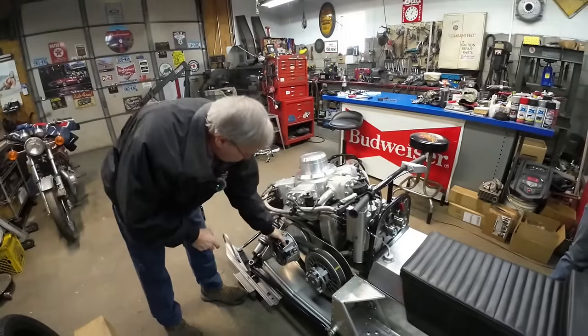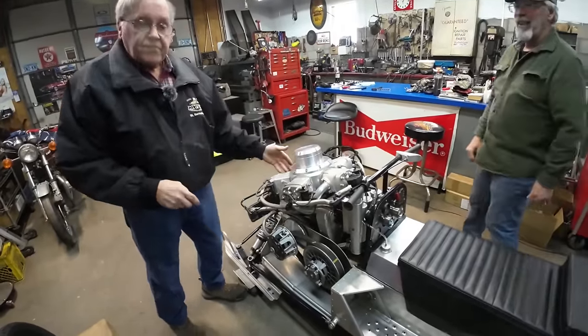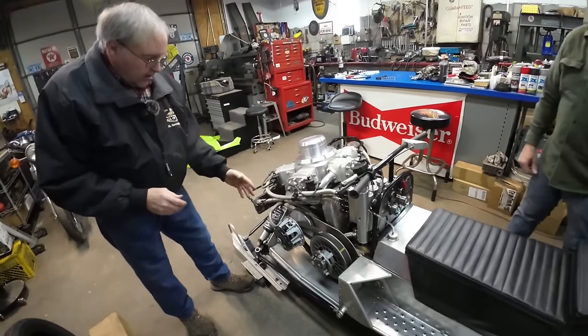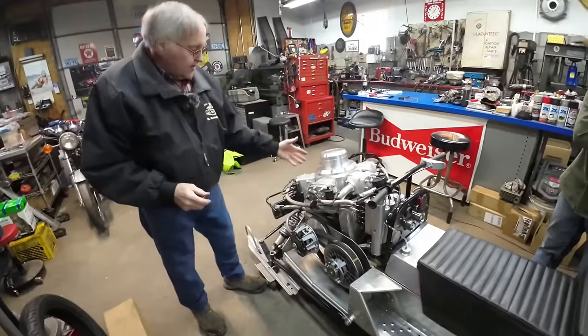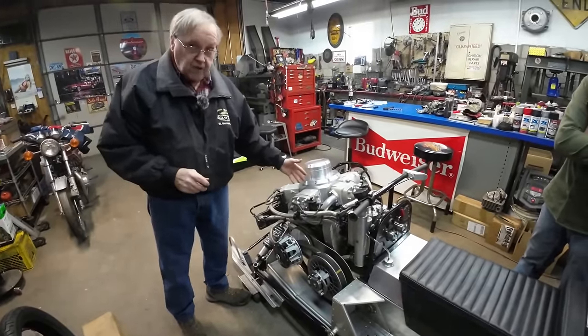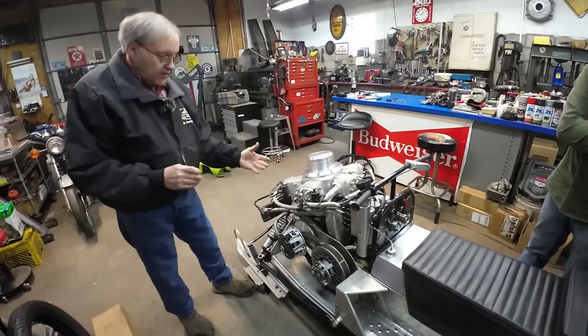Okay, so we have our normal snowmobile clutch. Kind of normal, Paul. I noticed it's got one more weight than I typically deal with. Well, it's a 108 Comet. It's a heavier duty, more of a race-type clutch. But you've got 1,100 cc's here. This thing should make close to 200 horsepower. Wow. So you need something that's going to hold it up.